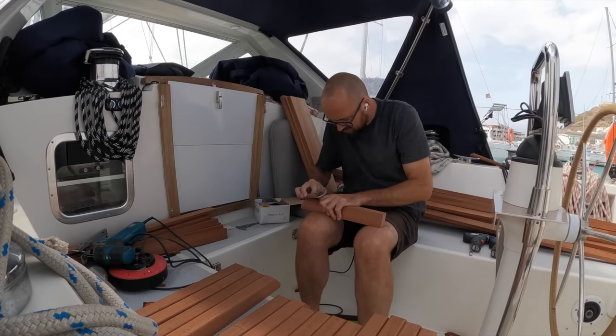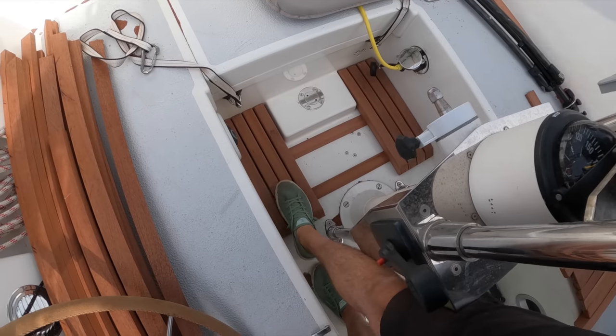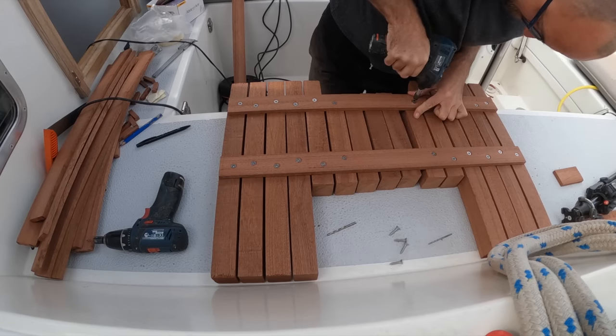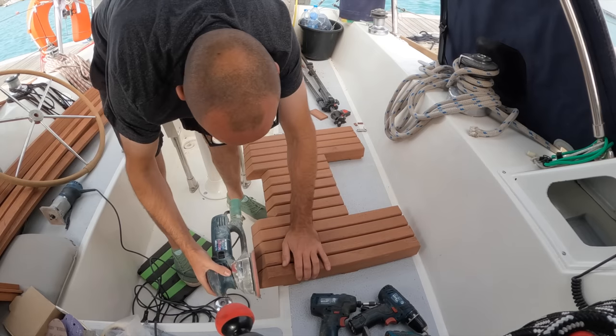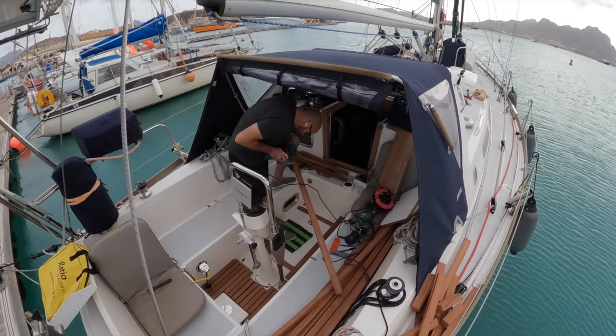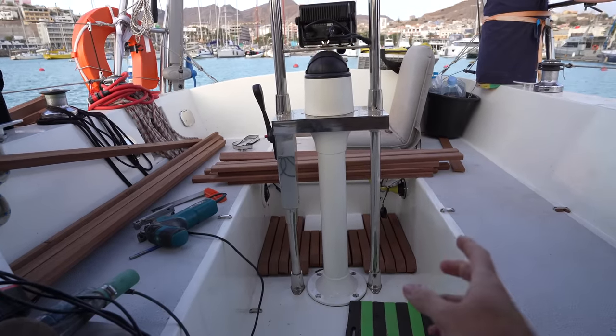After a light bit of hand sanding it was time to start assembling the first section. I pre-drilled and staggered all the screws to minimize the chance of the wood splitting. The first test fit was very encouraging and after a little more screwing I finally had the sweet luxury of a flat place to stand at the helm. I gave that section a light sanding before moving on to the forward section. I got all the pieces trimmed to size and the edges rounded over. Said screwing will have to wait until tomorrow because we're running out of daylight. It took a lot longer than I expected but at least the aft section is done. The gaps aren't 100% uniform but it's the best I could do.